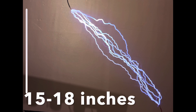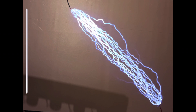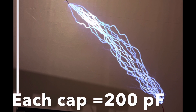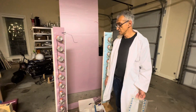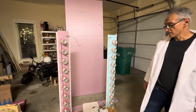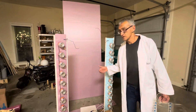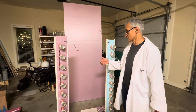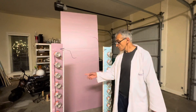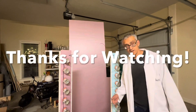Here's a really interesting light-trail photo of the discharges — you can see how random they are, and they're extremely bright considering I have 20 capacitors connected in series. I'm going to put up an Instructable or WordPress document showing exactly how I made this if you'd like to repeat the experiment. One word of caution: the amount of energy stored in Marx generators is pretty dangerous — I've already experienced a shock, it's very painful and could be lethal depending on the size of your capacitors. Thanks for watching, and please don't forget to like and subscribe.